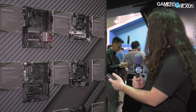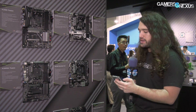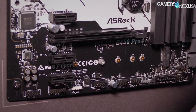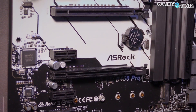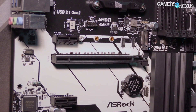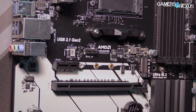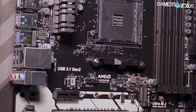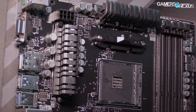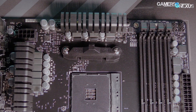The next board is the B450 Pro — there's a Pro 4 and a Pro 4 Micro ATX. The B450 Pro ATX board is also a 6 plus 3 phase, again unclear on the MOSFETs, and also an Intersil voltage controller. PCIe x16 for the top slot, x8 for the bottom, one PCIe M.2, one SATA, and end of July with price TBD. The Pro 4 series previously for the B350 was one of the better B350 boards — a lot of them had really bad VRMs and bad thermal solutions, but the Pro 4 was actually acceptable.